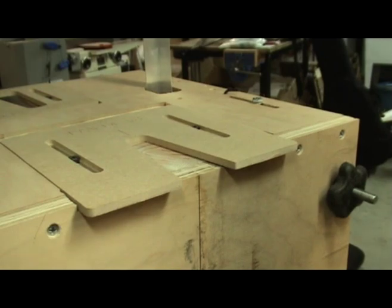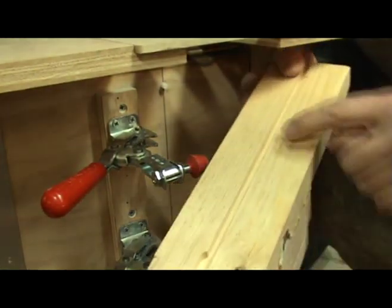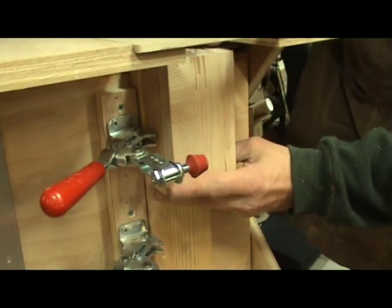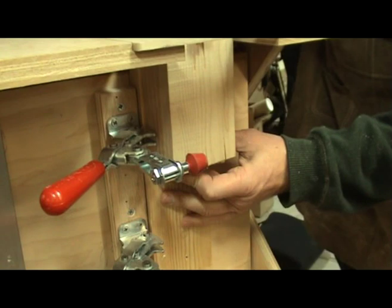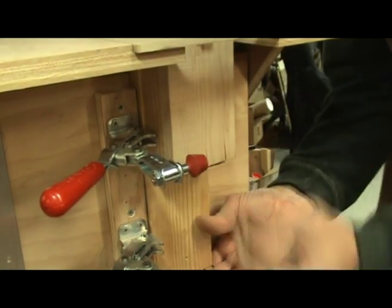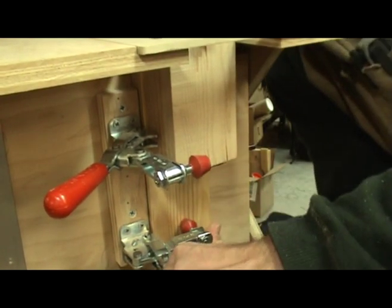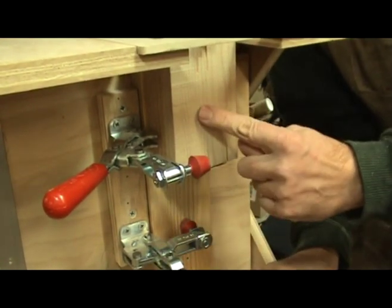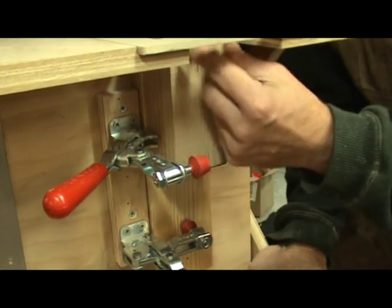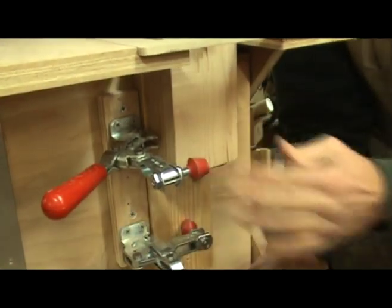So let's put the neck on the other side. On this side where the neck goes in, notice I have my 1/4 inch slot drilled for my truss rod. That just gets put right onto those dowels I put in there. Bump it all the way up to the top. And come in and use your clamp to clamp it up. Now on my test piece, I left a lot of excess so I can continue just chopping off the tenon each time, just keep testing. So this one will not be able to fit on there, but just one is enough.